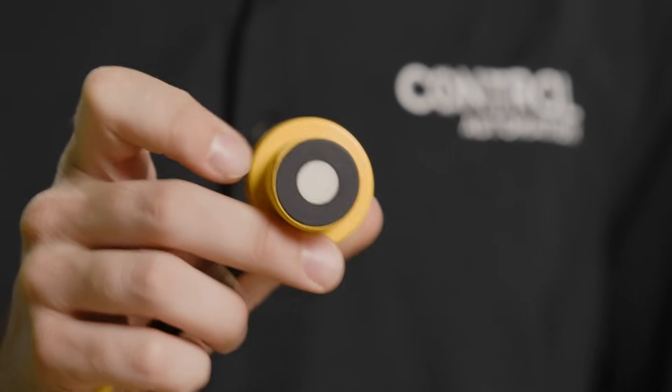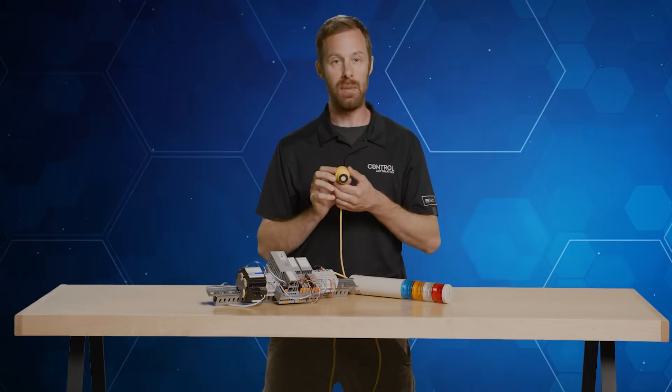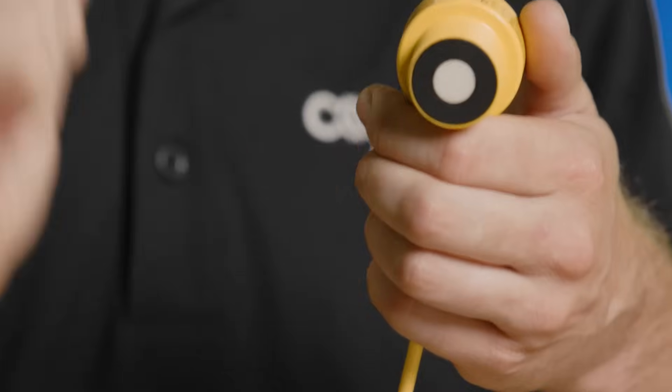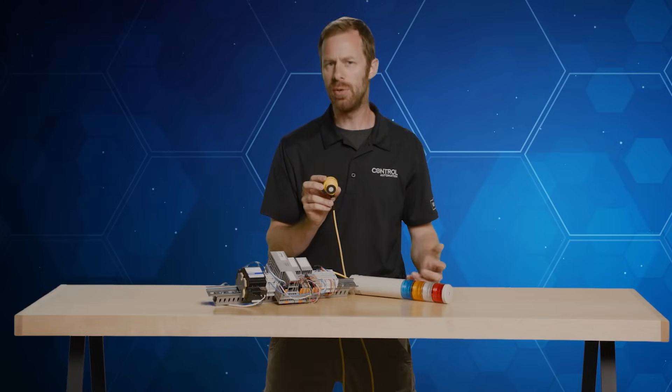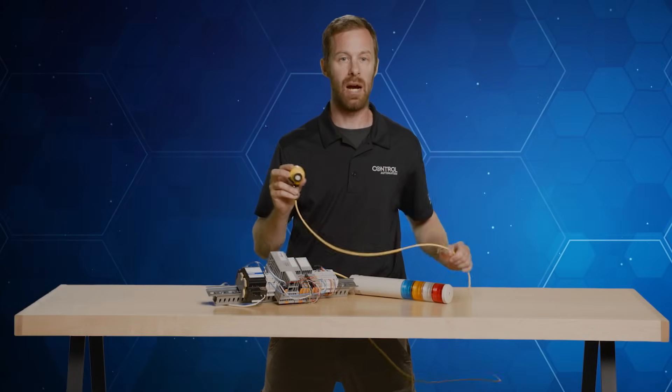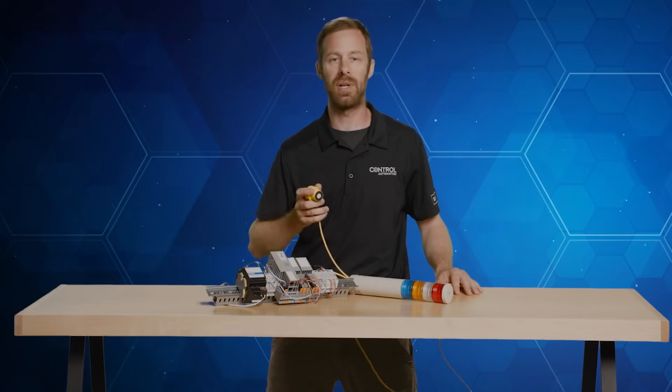The particular discrete output signal for this sensor is referred to as PNP, which means it provides a positive outgoing signal when it senses an object. The complementary type of output is called NPN, which means it accepts electricity from the PLC when that sensor is energized. Depending on the wiring setup of our PLC, we need to be sure we've chosen the right one or our system isn't going to work. The U-Gauge series from Banner also includes NPN outputs. There are other industry standards for voltage and current outputs, including voltages as low as 5 volts, up to 0 to 10 volts, and currents from 0 to 20 and 4 to 20 milliamp ranges — all very common industry standards.